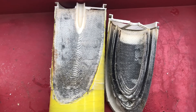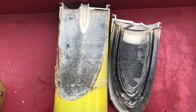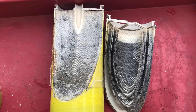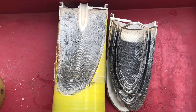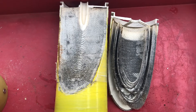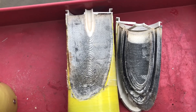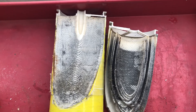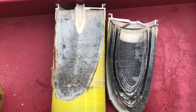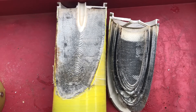The product water was around 60 microsiemens with no consumption, with product water recirculating back into the feed side of the membrane. If we consumed any water, the product conductivity would shoot up over a hundred microsiemens. Our percent rejection was below 95% at idle and dipped into the upper 80s under any water usage.